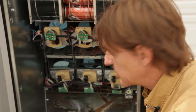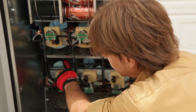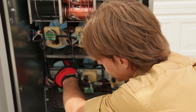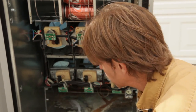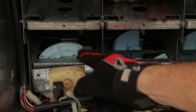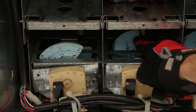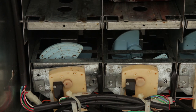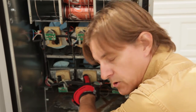Now that I have the motors exposed, we can see a little bit better how this mechanism works for releasing product. The motors turn this plastic part, and there are two paddles that are offset from each other 180 degrees. The first one pops up and keeps the product from rolling out. When somebody makes an order, it rotates so there's a paddle behind keeping the product from coming out more than one at a time, while this one releases just one. It lets one product come in and then dispenses it. There's a sensor switch so it knows where it is in its circular rotation.